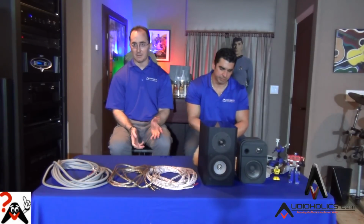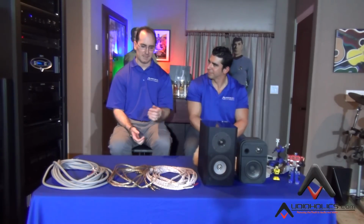popular. It is, yeah. So, with bi-wiring, my suggestion, if you have a good set of cables already that have low impedance, 10 gauge or 12 gauge equivalent resistance, bi-wiring, you don't really need to do it. If you've got extra cables lying around that are identical and you say, hey, I want to put them to use, bi-wire all you want. I mean, it's fun. You just tie them together on one end, put it on the other, and you could brag to your friends, look, I got my speakers bi-wired. Ooh. Ooh. So I think that covers the bi-wiring.